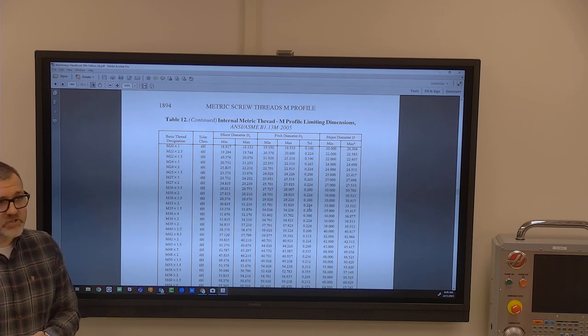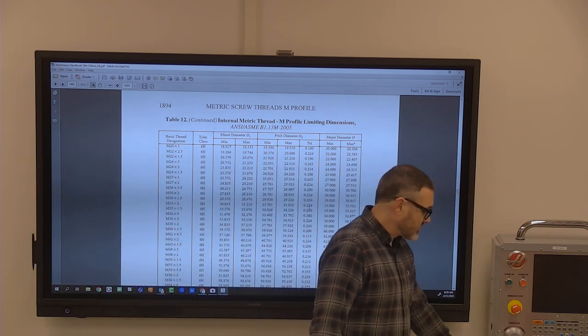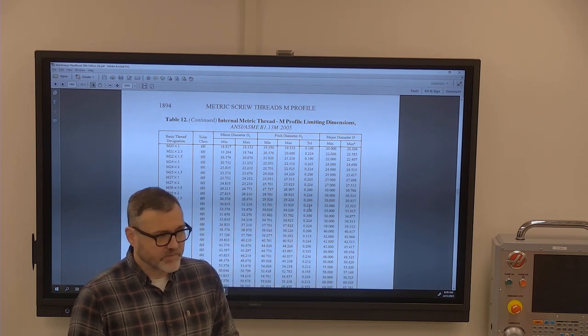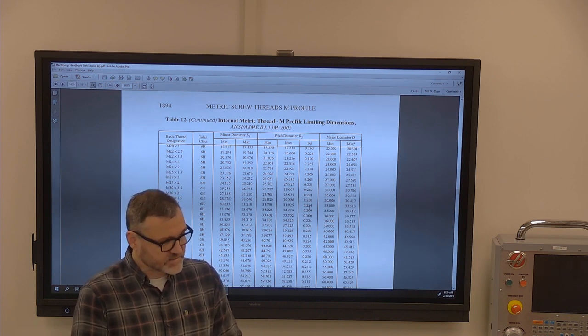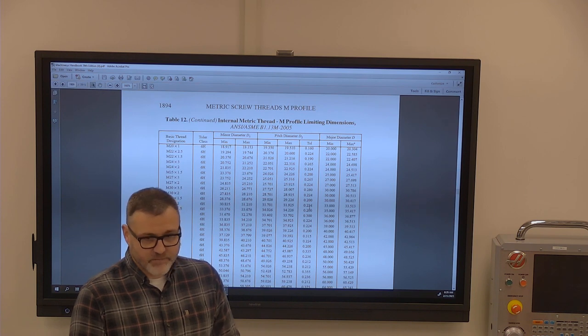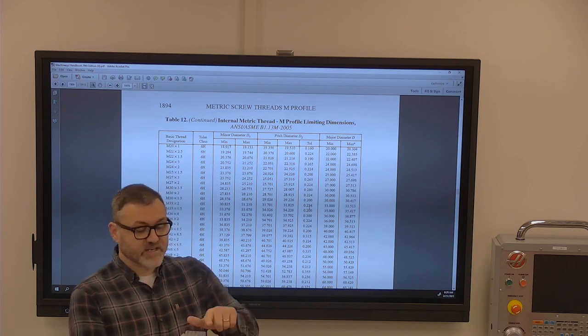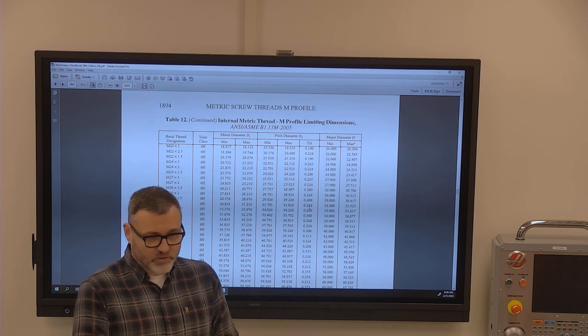What GD&T actually works off of is form, fit, function. Does the part still work? Does the part work for the thing that I'm working on? And that's really where a lot of things come into play. That's where we start to build datums, like our primary datum, our secondary datum, and then our tertiary datum. So if this is where this thing sits down and it nests in like this, primary, secondary, tertiary, A, B, and C, for how it sits down into a pocket. Now, if this thing, let's just say this face had a dip in it, it would still work, right? Is it nested down into a corner?